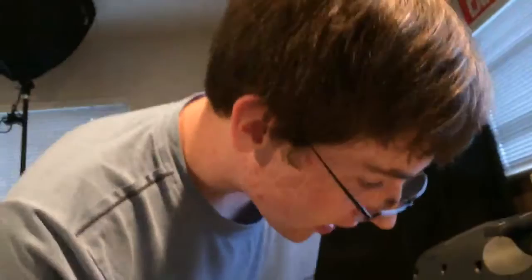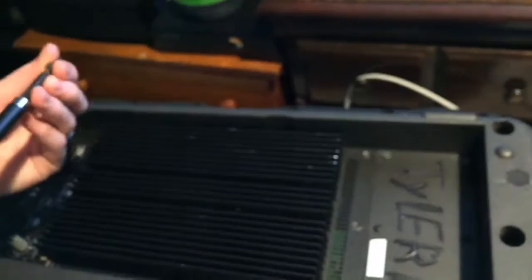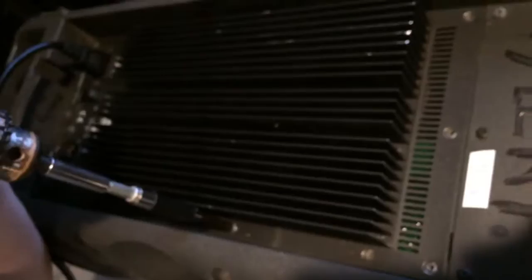Alright, this guy is adjusted — we're at 4 and 4, which is a perfect reading. They say to adjust between 4 and 4.5 millivolts. Now that we have one with a perfect adjustment, I can't wait to hear how this one sounds compared to the other one that wasn't able to be adjusted right. This should be interesting.